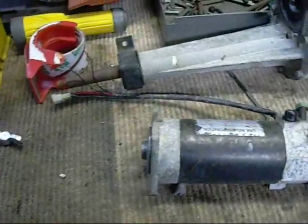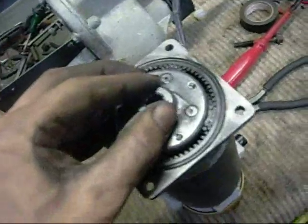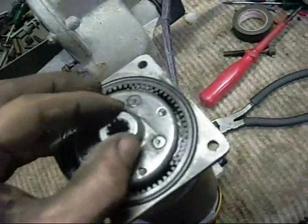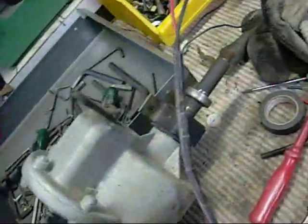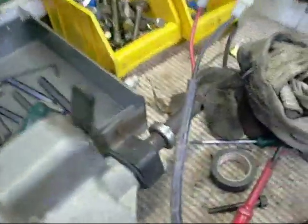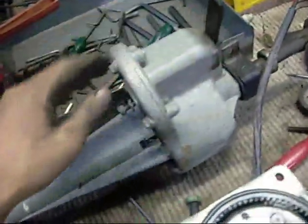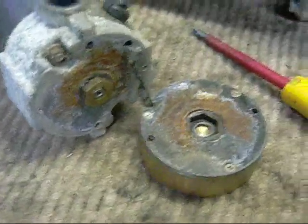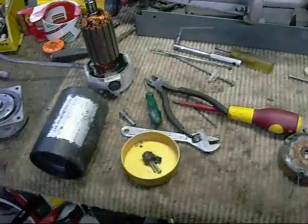Okay, I'll give it a quick test with 24 volts, and here's the motor's open circuiting. Little helical gear drive in there, which is free, but the shaft itself isn't. May have seized up and just burned itself out on whatever it was installed on. That works. Okay, well, this motor's fitted with an electromagnetic brake, which is subsequently frozen from water ingress and other problems.